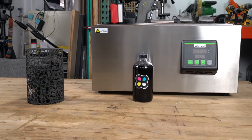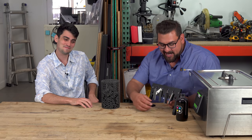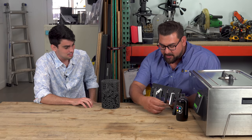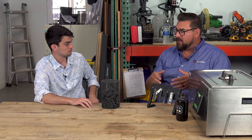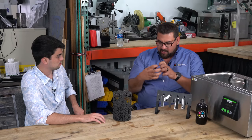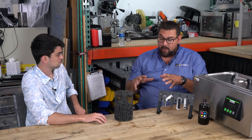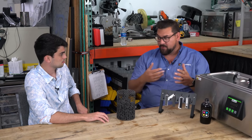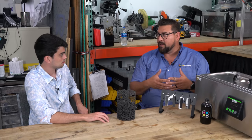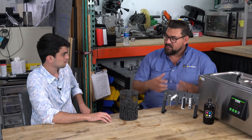But you're telling me we can make them look even better? Absolutely. If you look at these parts, this is what you're used to from just brushing the parts. Here we have the ability to do blasting, which gives them a nice textured finish. From there we can put them in this dye tank and it's going to dye them black — a really nice deep black color for all the parts as a batch process. This is actually the 3D Chimera Dyeing System with our proprietary dye. There's a really important step here for polishing — once you polish the part, you're basically closing up all the pores on the outside of the part. So if we want to dye them, we have to dye them first and then polish them. If you go the opposite way, the dye won't soak into the part — it actually helps make it even more watertight once it's polished.